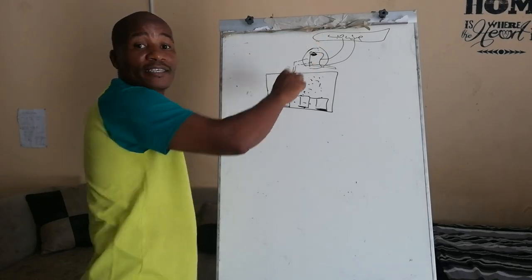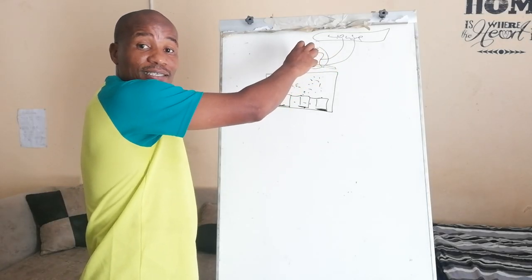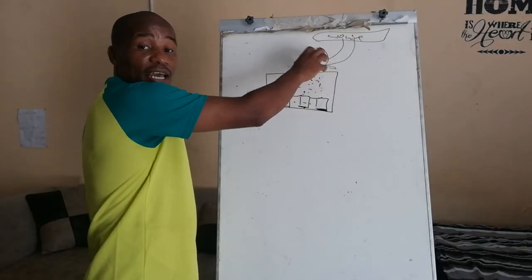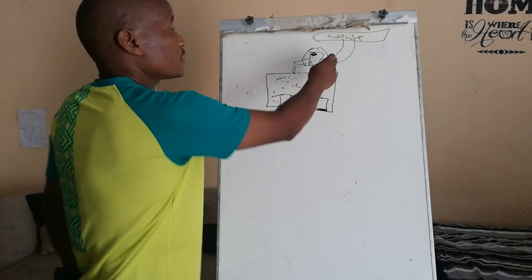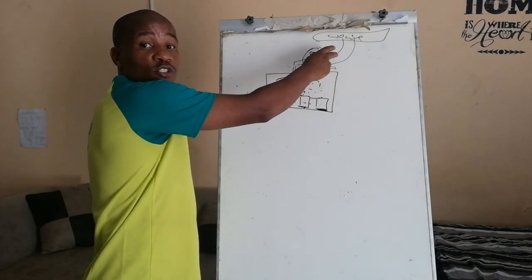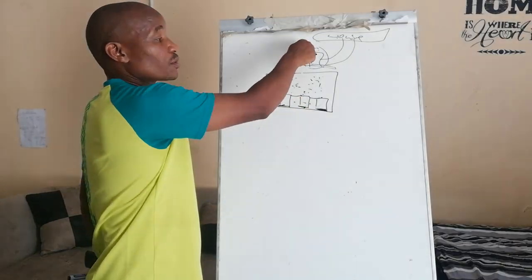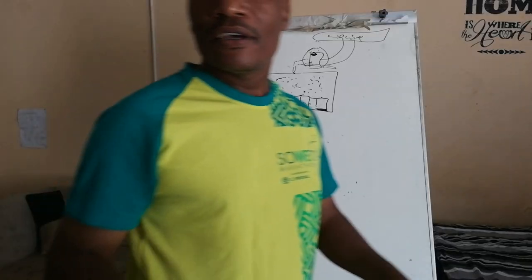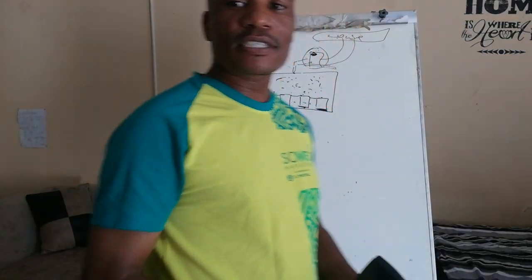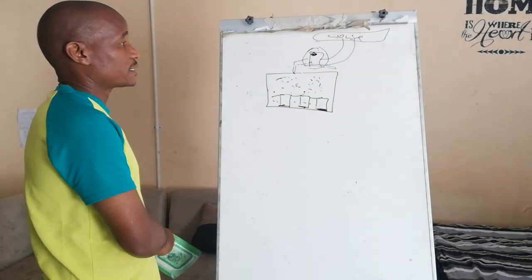On the upper one, it is connected to a float. With more gas accumulating into that float, it will cause the float to operate. And as it operates, because the mercury switch is connected to it, the upper mercury switch will sound an alarm. That's the basic, simple operation of a Buchholz relay.